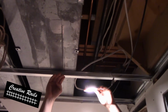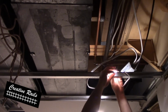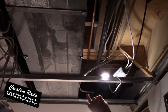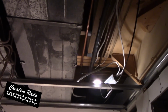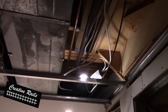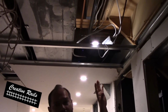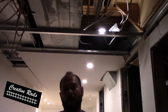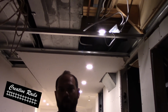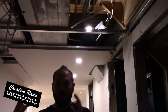I've done this because, as you can see in this bulkhead, we've got this ductwork happening. The other thing I've done, everything down here is framed in metal. You see this here, this is called hat track. It's what we normally call it around here anyways. It's really popular in commercial construction, and it's become more popular in residential construction, more for framing bulkheads.